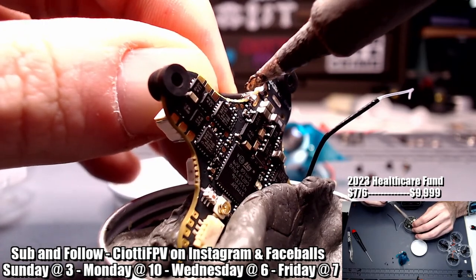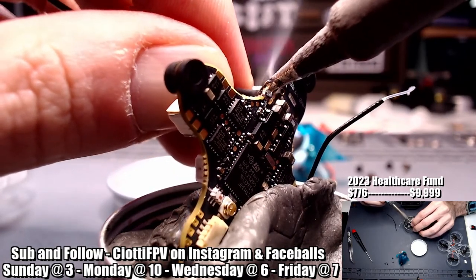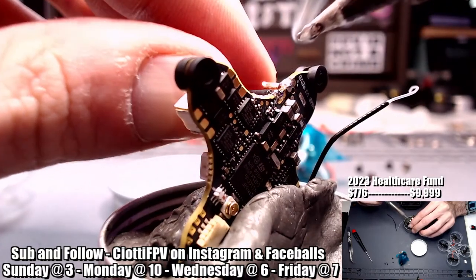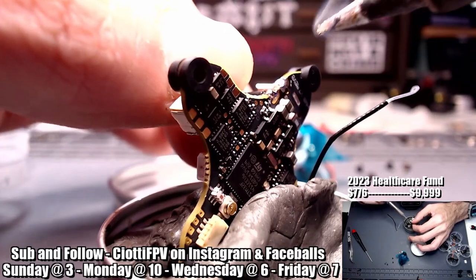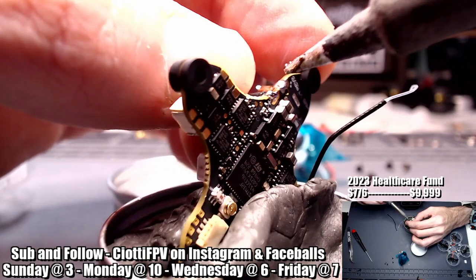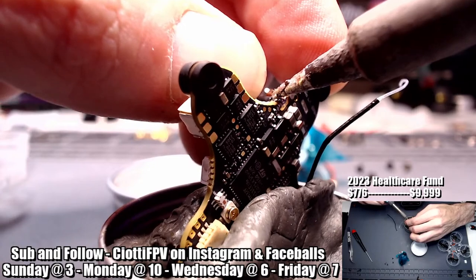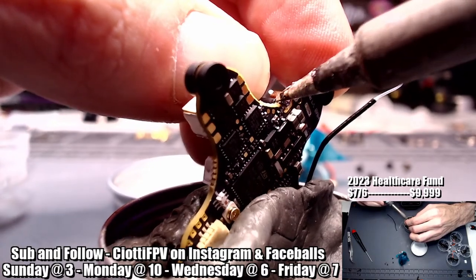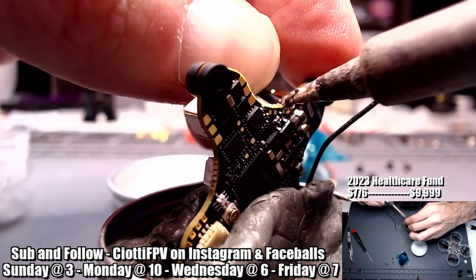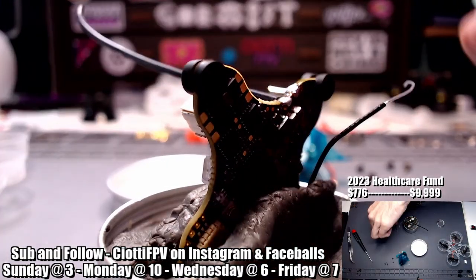Get it in position. Bring the tip of the soldering iron in just for heat. You're not going to use it to push. And that looks pretty good. Let me just make sure. I'm going to put one finger on top so I can hold the board a little bit more steady. So these have these little pockets on the outside of the board for you to push this into. And in this case, you are actually going to push a little bit with the tip of the soldering iron just to make sure it's in that little pocket. And now we're good to go.